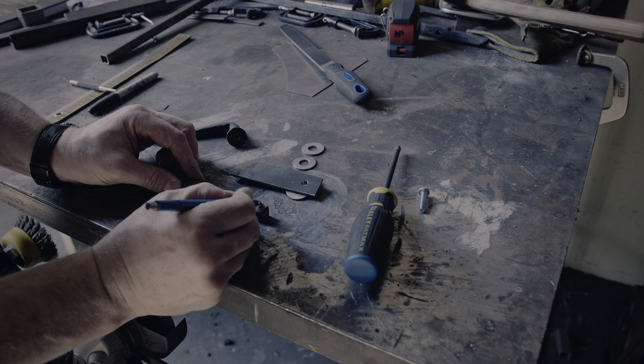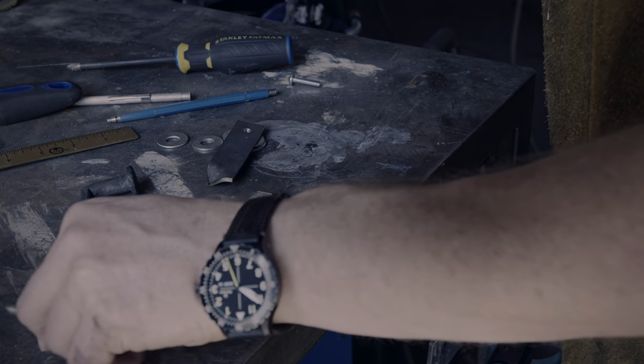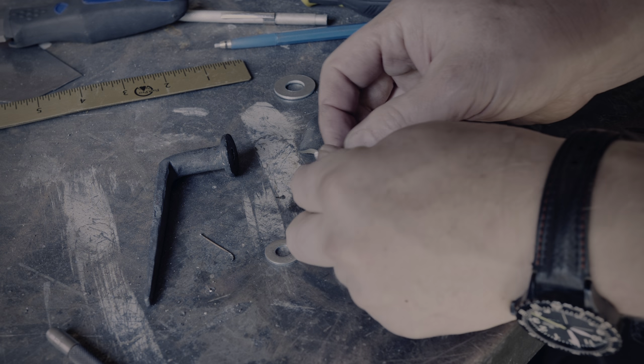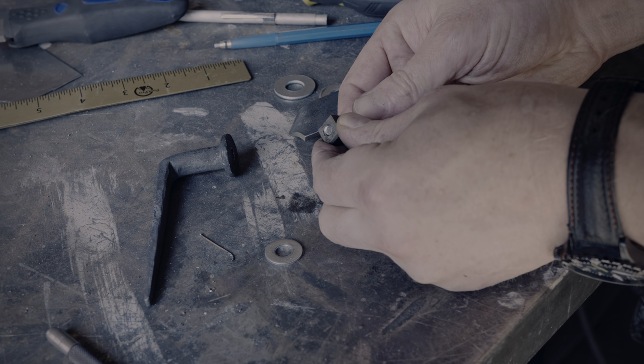The one ingredient that is still missing is a piece of square steel that can move the latch. I will just weld that on. This could have been done with blacksmithing, but would have been much more involved. As you can see, I chamfered the corners to have more surface area for welding. This should be sufficient for it to hold together.